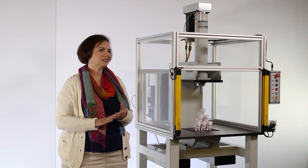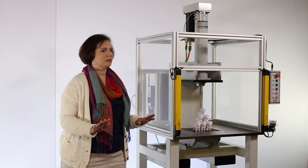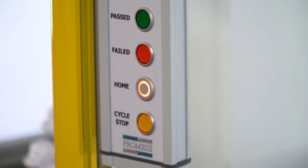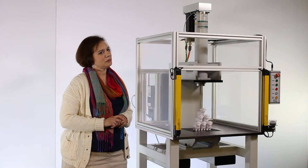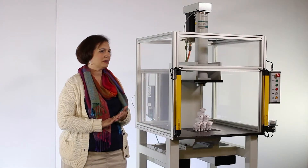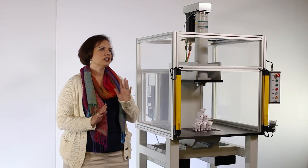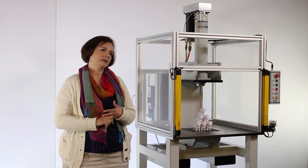The station can handle most pressing applications, even synchronized motion, without the need of a PLC. It has a push-button control box for simple machine operation, and the HMI software allows you to program the station as well as see the data that's collected during the process, such as peak force and final position.